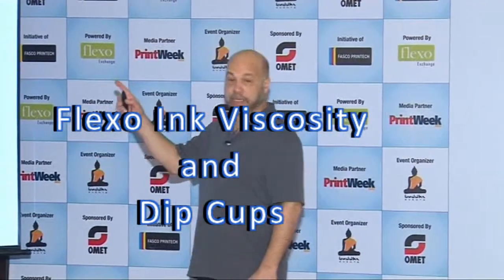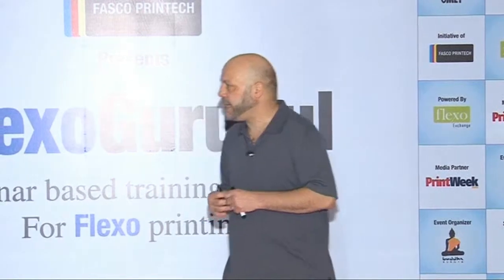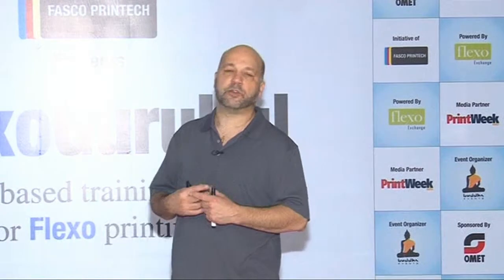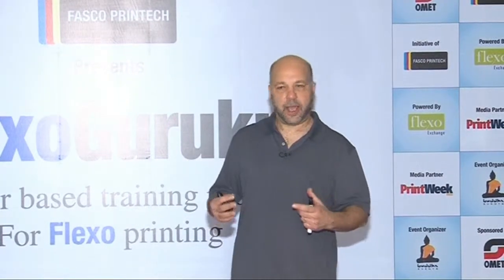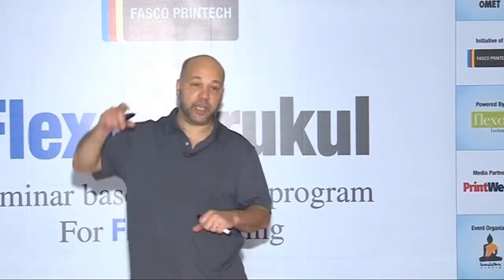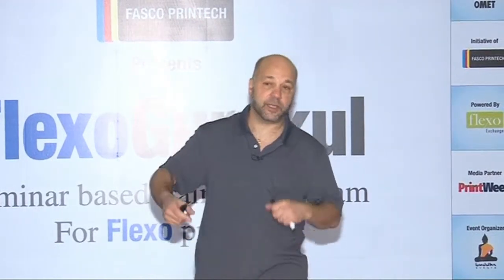So now we've talked a lot about viscosity, and these are the things we're going to check. Let's see what viscosity looks like a little more close. Viscosity is a measure of a fluid's resistance to flow. The more a fluid resists, the higher the viscosity. Honey resists flow more than water does — water will flow more readily — so honey has a higher viscosity than water.